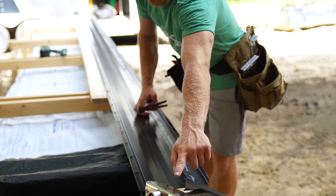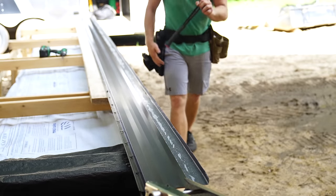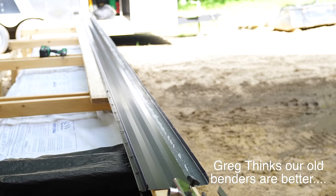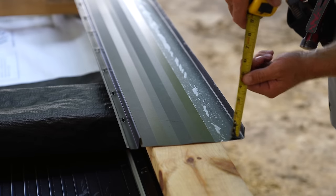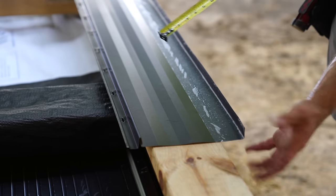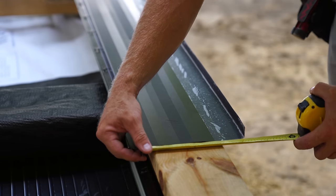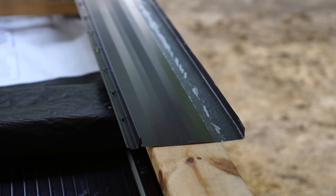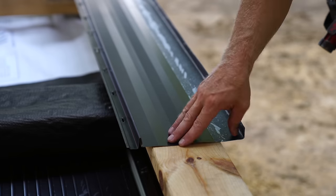Now you can see we've got this bend up. What's important is when you make this cut in your material you want that to be as straight as possible because the rollers are guided on that cut. We only did a 7/8 inch bend up because our trim is only one inch - we don't want it, due to any discrepancies in our install, to be bigger than an inch. That trim will cap this. We're just under 8 and a quarter, so we can go ahead and hem our end, take it up, and start installing.